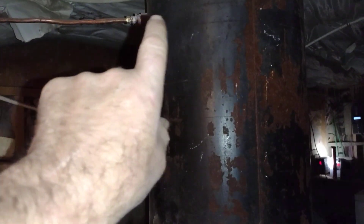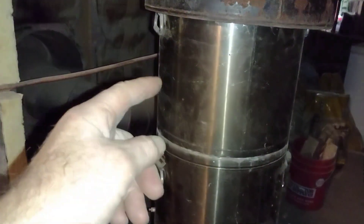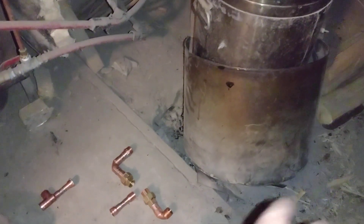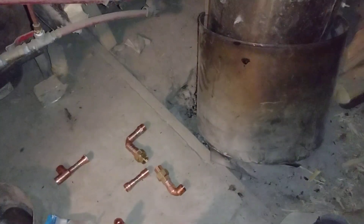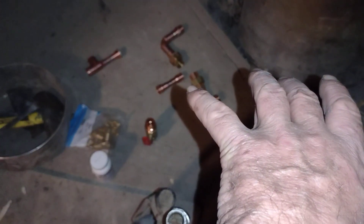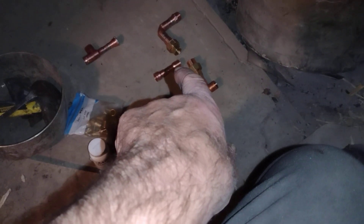This comes from the top of the tank, comes down, and then there will be a tee that picks up the hot coming out of the coil. Then it goes down, out to the floor, through the floor like a radiator, then back up into this system — which is much more efficient. That tee picks up the hot from the coil.